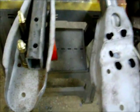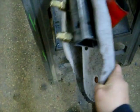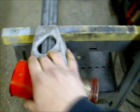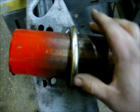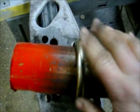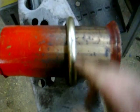So what I got going on here, I'm going to do a double U-bolt. So it'll be, flip this over. So this is simulating my axle tube coming across. I got 2 holes drilled out for this U-bolt. These holes here were actually the original holes that held the Buick rear end on. It was kind of weird how they did it, and I'm not going to redo that because it was hard. I'll get normal U-bolts, and I got 2 holes drilled through the box steel, and I just didn't feel safe running 1 U-bolt, so we're going to put 2 in.